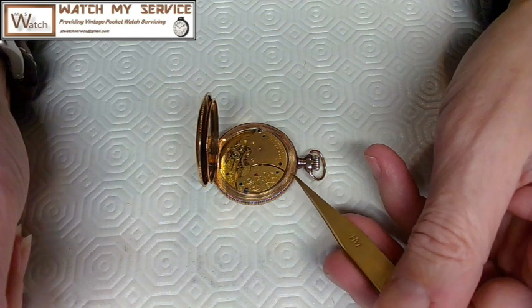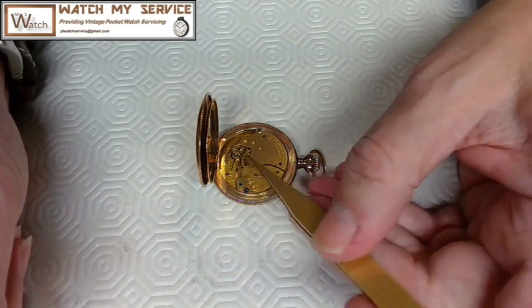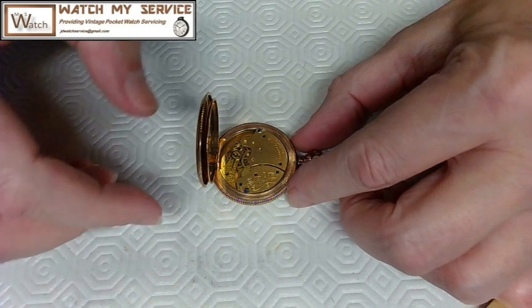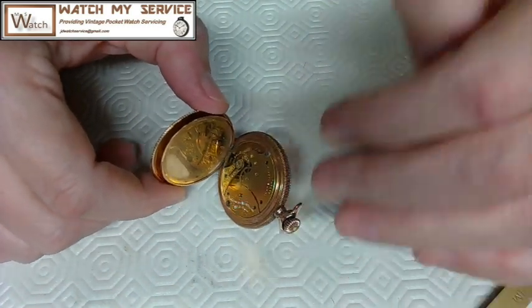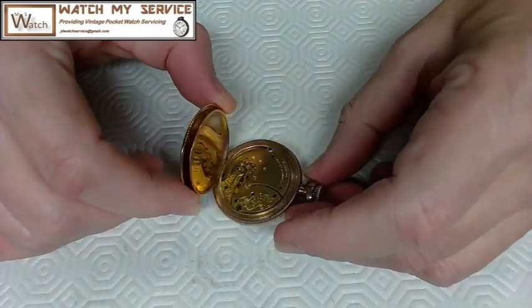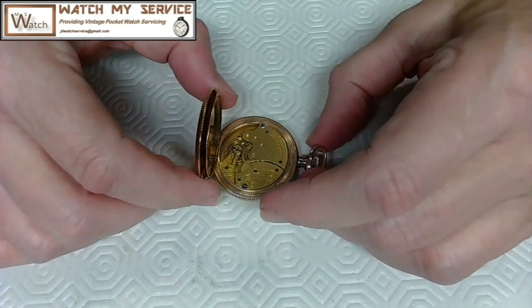So then on the weekend, I decided, well, let me look at the hairspring on this balance here and see if I can look at it under my microscope as it's operating, right? So I looked at it under the microscope, and then I put the watch sideways, and I looked down kind of at this kind of an angle so I could see the hairspring operating. And what I saw was two leaves on the hairspring were touching each other.